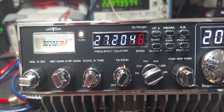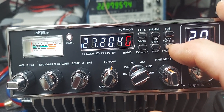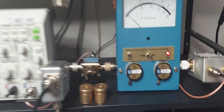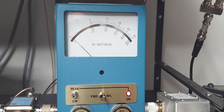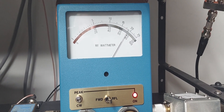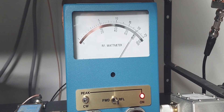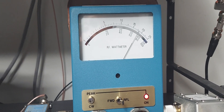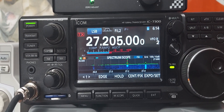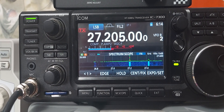When you hear people you just turn the dial so they sound natural. The mic gain is all the way up, RF power all the way up, the amp switch is off — so this is just the radio part, not the amp. On the 100-watt scale it's about 70 to 78 watts. You have to limit it a little more on sideband or else it gets really nasty sounding. I'm listening to it on the Icom here — it's right on frequency and sounded pretty good.